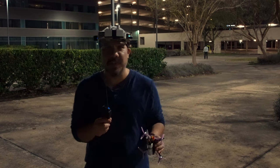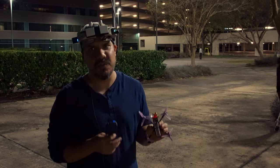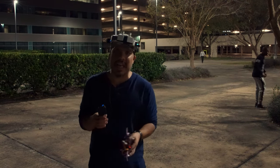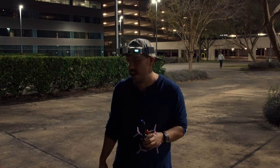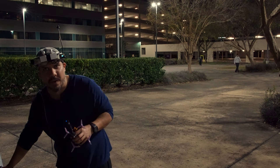Now, I don't know about this video transmitter. I had trouble when I lowered the power output down to 25 milliwatts. That's what we fly here at the night spot and at pretty much every race. Now we do that low power output to be able to get the maximum number of pilots in the air, and I noticed I couldn't see anything when people were powered up.